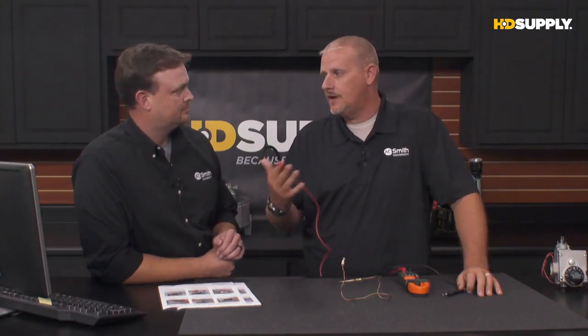Anything above 10 millivolts, you're fine, that's a good thermocouple. You may see anywhere between 10 to 30. If you get 17, 27, all that's fine. If you're not getting 10, if the number is below 10, then your thermocouple is bad and it needs to be replaced. This will happen from time to time. It takes a while. Honeywell says the average lifespan is about 100,000 hours. If you do the math, it's about every 10 years.